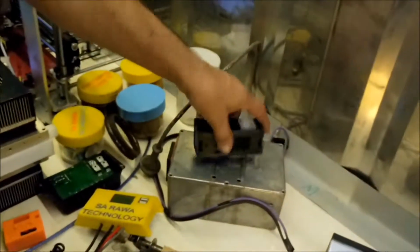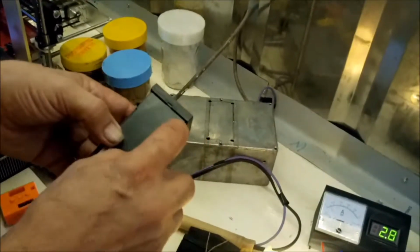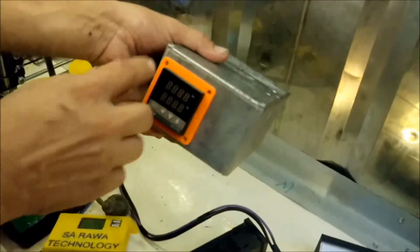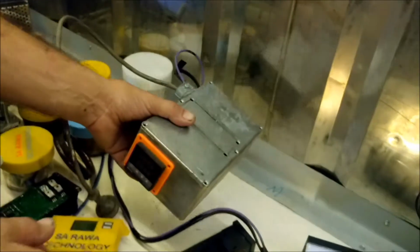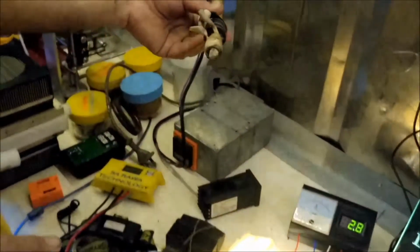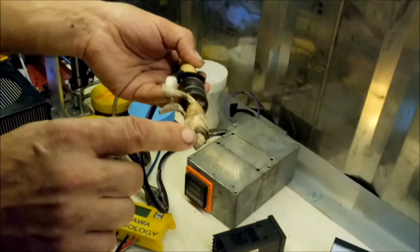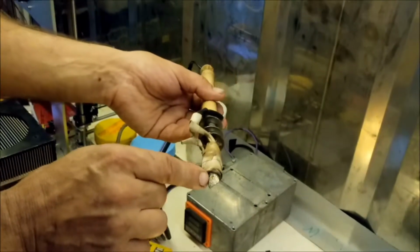Here's another temperature controller. This PID is very good, very practical for many applications here, but the small shoulder is very difficult for us to work with. So we just cut a hole with a grinder, and then the 3D printed frame makes it easy to install. This is a 12-volt soldering iron that's excellent for solar systems. Because of the large tip, it's possible to solder the thick wires. The temperature sensor is right in the tip.